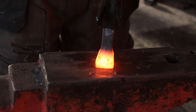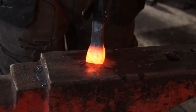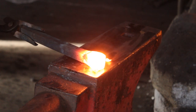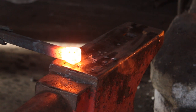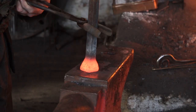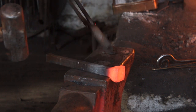I'm quenching it off below the centre dot and that will just save distortion. Any distortion you do get you'll have to straighten out as you go along and dress the shape of the upset as well, because you want it to be even on all four faces. Continue until it is an inch long.